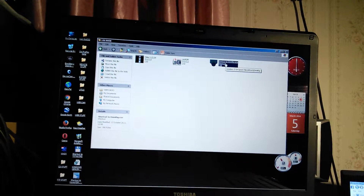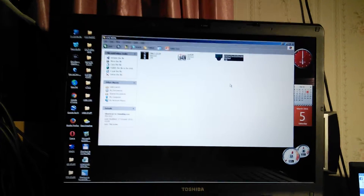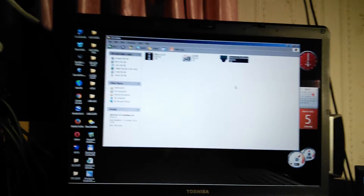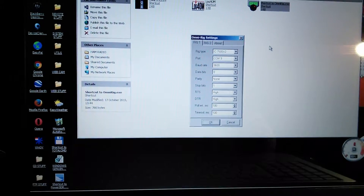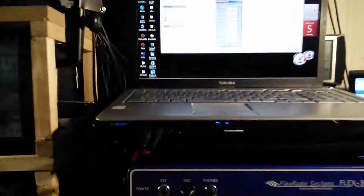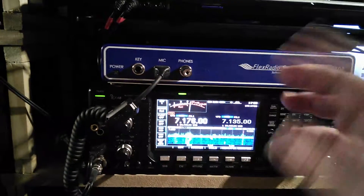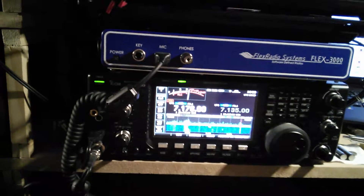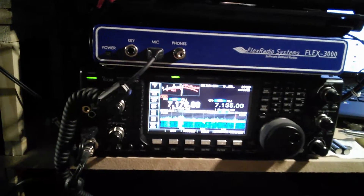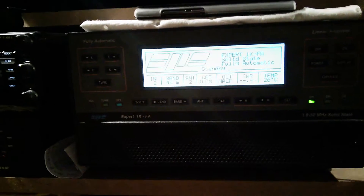So I have to go and click on it again. The program will load up — it does take a few seconds. When it does, there you go: ICOM 7600 version 2, because that is the version I am using. I am using COM 9 because I have all different COM ports on there, and 9600 baud. So 9600, or I can put the radio into Auto and then they try and talk to each other. I can see there is some kind of mix-up.